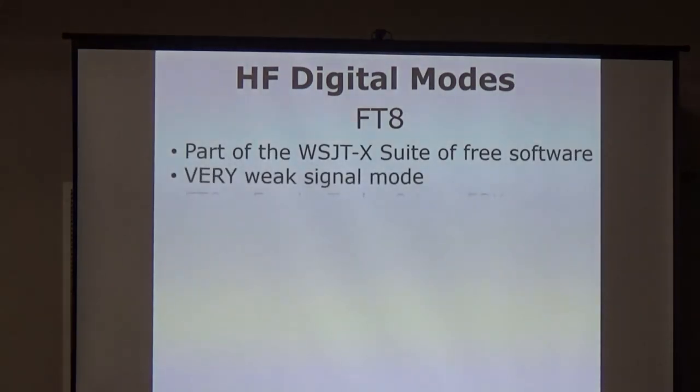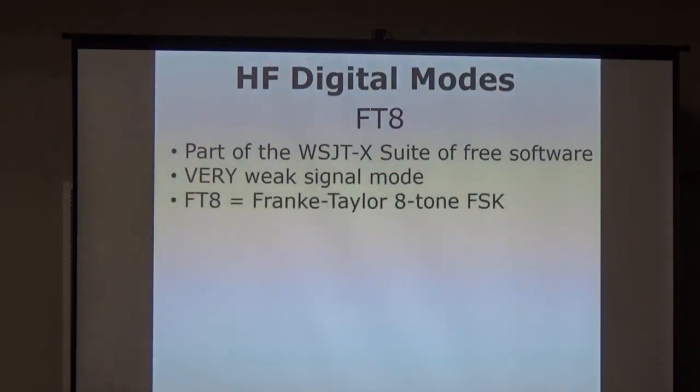As a technical achievement, FT8 is amazing. If PSK31 is a weak signal mode for fair to poor propagation, FT8 is the nearly invisible signal mode. It is quite capable of pulling out a signal with signal-to-noise ratio in the single digits. Single-digit signal-to-noise ratio. It can pull it out. It is specifically designed for poor propagation conditions using low power through a marginal antenna.